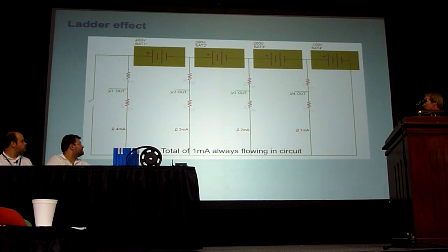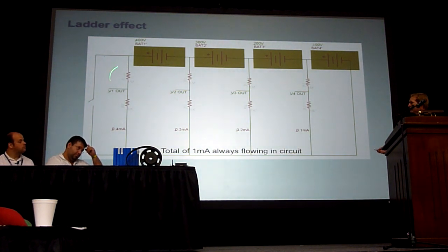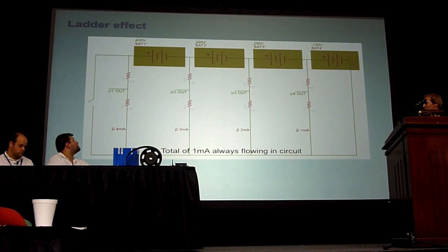This is just a diagram that shows that. Basically what happens is you get a continuous flow of current through the pack even when the contactor switch is open for the whole pack. With megaohm resistors for shunt resistors, it only ends up being milliamps — but it's milliamps per second, per minute, per hour, and so on. On top of that, you've got current that just sort of gets through one set of batteries. So you can't really balance each set of batteries.